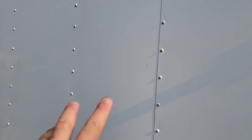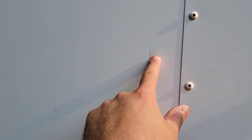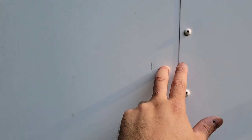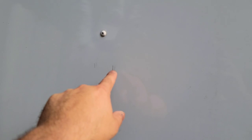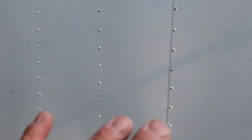Instead of an inch and a half I gave myself an extra quarter inch because we're going to put rope lights outside, so you want clearance for the tape lights we're going to add. So now it's an inch and three-quarters off this lip. It might not be the same for your truck, but remember you want to hit studs. From there we go 77 inches to the left side — that first line — and then an inch and a half, so we grab that stud as an anchor point. You get one shot at cutting the exterior skin, so make sure you do it right.